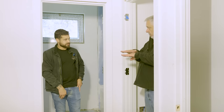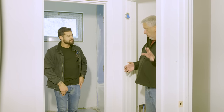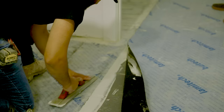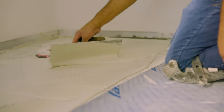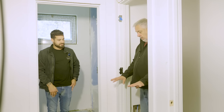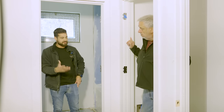A lot of guys come in and put down quarter-inch cement board, screw it down, then put the mortar right on top and put the tile. But we're not doing that — cement board is a little old school. This more modern system protects the tile from movement. Porcelanosa has their whole installation system: they sell tile and we're using their tile, but they also have their complete installation system — one company owns the whole system, so there's no finger-pointing between suppliers if something goes wrong.